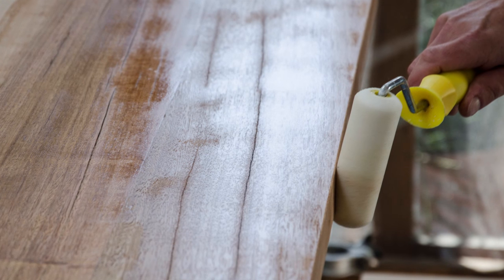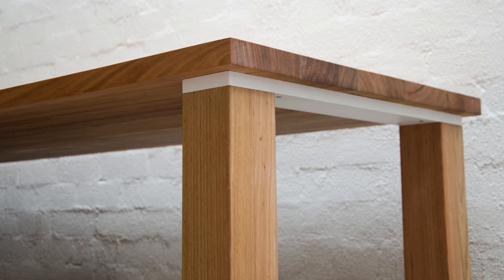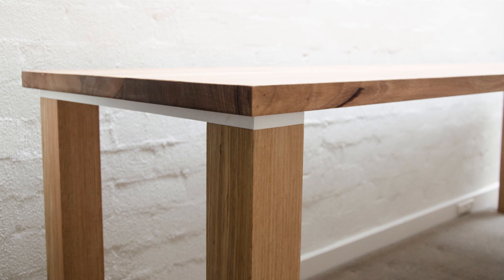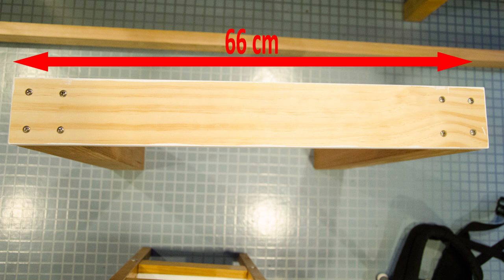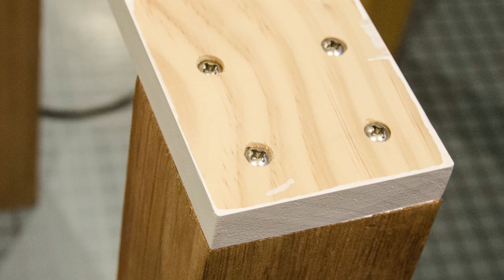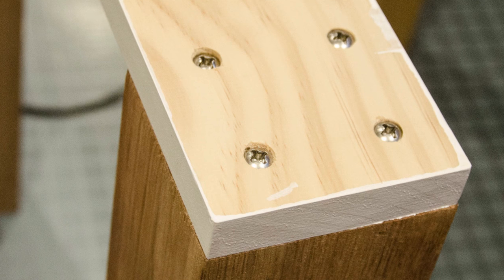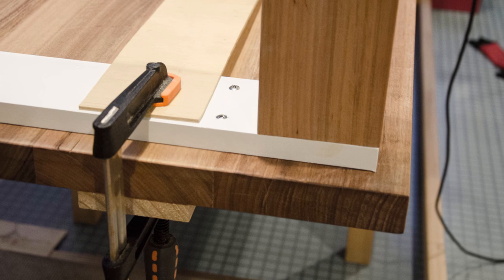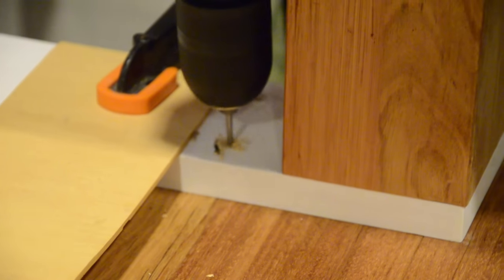Do the same with the table legs. The next step is to fix the legs to the table. By using fairly thick hardwood planks, the table should be really stable. We painted two timber boards white — the boards are approximately 10 cm wide by 66 cm long and around 2 cm high — and fixated the table legs with four screws and a bit of glue. We set back the legs around 2 cm from the outside of the table top edge and fixed it with four screws so that we can take it apart at a later stage.